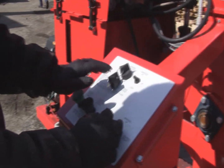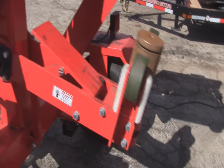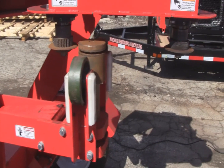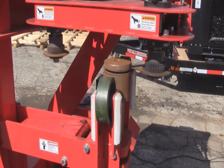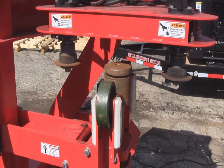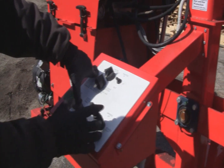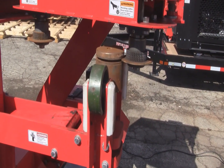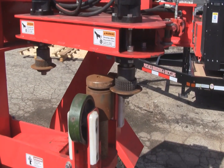In order to make this thing function, you have to hit one of these two enable switches and you can lift the mandrel up. Once it's lifted, it'll allow you to move the mandrels either left or right to do the cutting. If you come across a tire that has an interrupted cut and you need to enter into that cut, you can line the tire up and enable it without the blades turning to pierce into the tire, then start the blades. It will not let you move the mandrel down unless the head is completely disengaged, which will happen automatically if you're not touching the joystick.